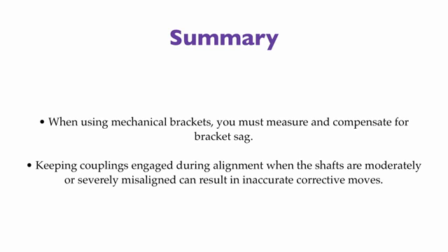I frequently get strange looks when explaining about elastic bending in shafts. It's natural to be suspicious because it is difficult to visually see the bending occurring with your own eyes. If you're in doubt, try this experiment: pick a drive system and align it. With the coupling on the shafts and engaged, install 100 mils of shim stock under every foot on one of the machines. Set up your alignment measurement system, take a set of readings across the engaged coupling, and solve for the moves. Let me know if the solution was to take out 100 mils from every foot.